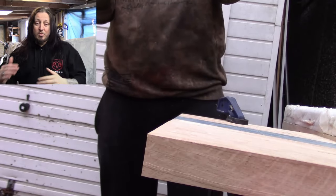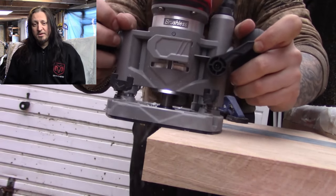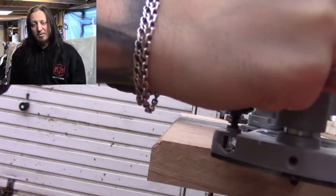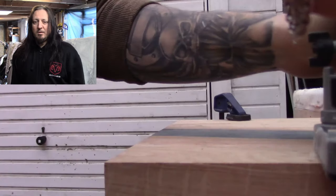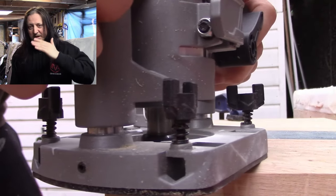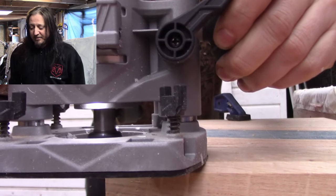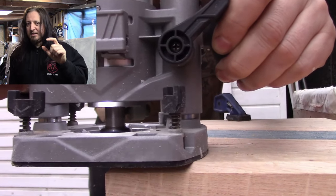When I flattened it down from both ends, I wanted to produce that chamfered edge, 45 degrees on it. So I used one of the attachments they sent me, and again, that produced a beautiful finish. I probably could have done it with the angle grinder and just by hand tried to get to that level, but I will never get the same precision and the same amount of finish. There will always be a bit of human imperfection by hand, because you just press a little bit too hard, then you get a wavy finish, and I wanted to avoid that. So having the router is really taking it to the next level, just a little bit better than doing it by hand.